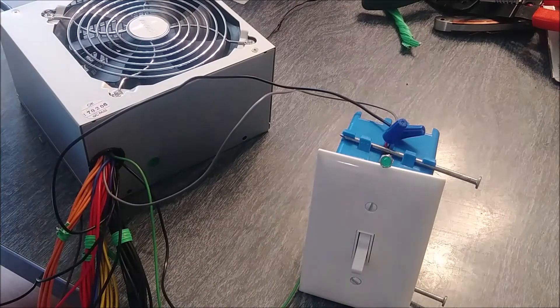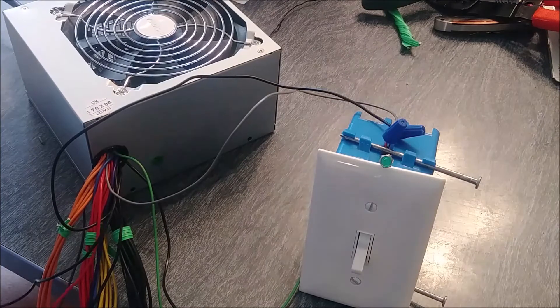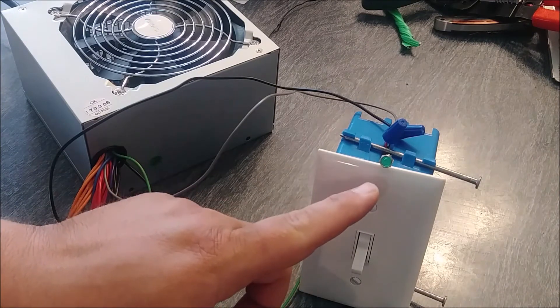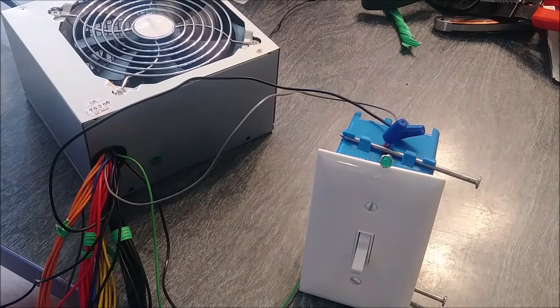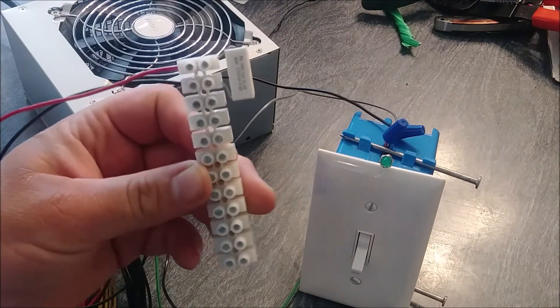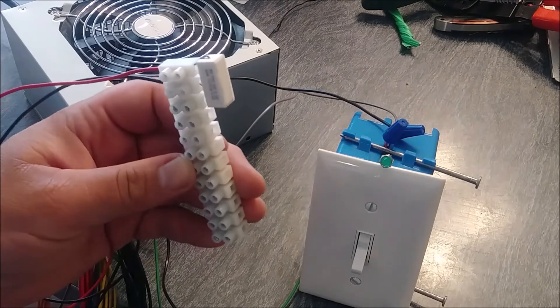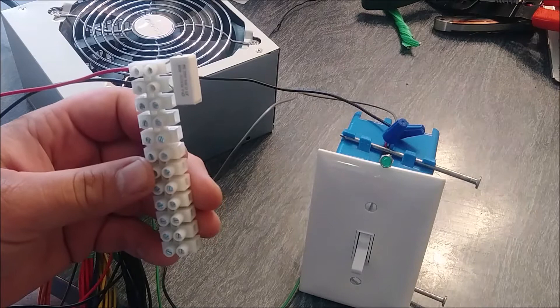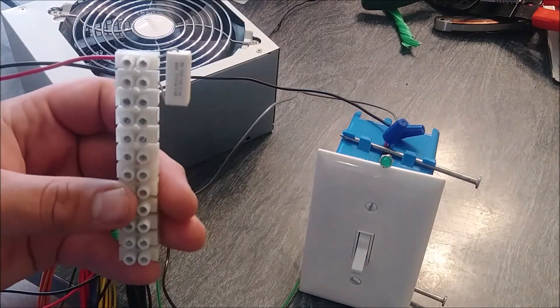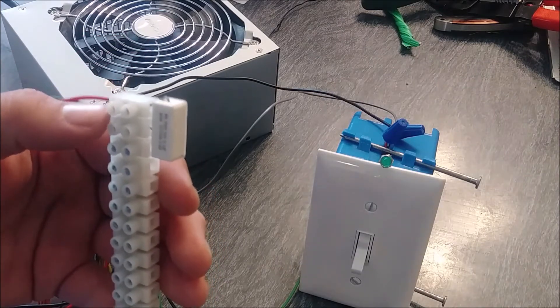This is going to be underneath my layout — that's the plan for now, out of sight. That's why I have the light switch hooked up. I bought an LED up at Radio Shack — yes, I found an independent Radio Shack dealer where you can still order parts; there's one about three miles away next to the Home Depot. I also took a play out of Tom Kovicek's book and got the 5-watt 5-ohm resistor. Tom from Tom's Trains and Things said that's probably the best option to get fluctuations out of the 12-volt and 5-volt lines — he was getting some 4.7V readings, but with the resistor was getting 5V.